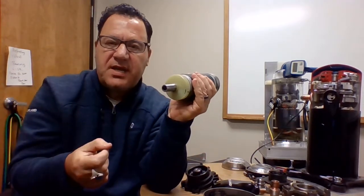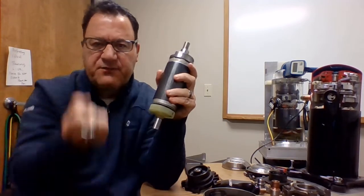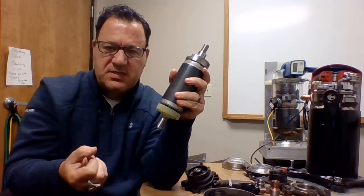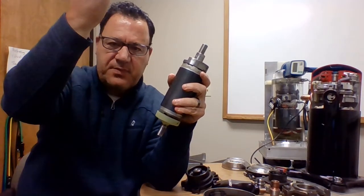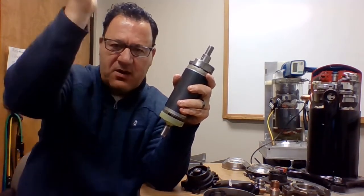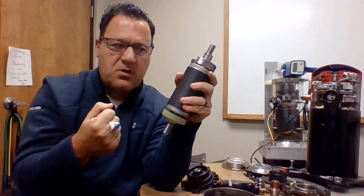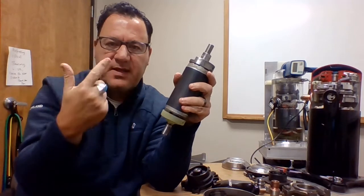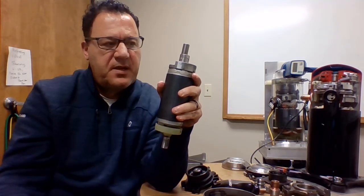The hole at the bottom of the shaft is drilled out slightly smaller than the top of the shaft, giving that vortex effect. I want you to think of that almost like a tornado, if you will, drawing up through that straw as it opens up, okay? It's slightly flared at an angle there, which helps with that. It's moving 3,600 RPMs, almost like a barber pole effect with that centrifugal force. Oil goes up like a candy cane, spirals up there.